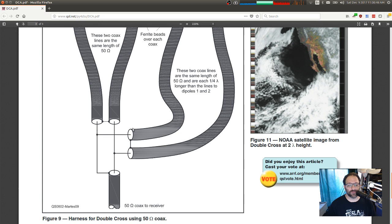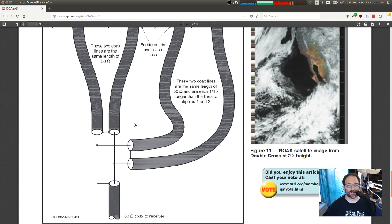The standard way of doing this is just get all of the coaxes, cut them, split them, and solder them together in a giant blob, and somehow that doesn't really appeal to me. What I want to do is put SMA connectors on all of these, including the input, and then just have a little tiny board with the SMA connectors on it that will do all of the proper phasing in parallels and series and all that fun stuff. So that's what I'm going to work on today.